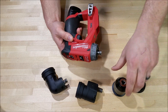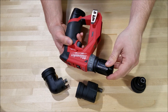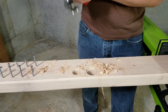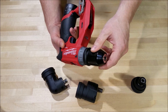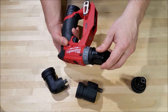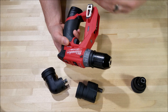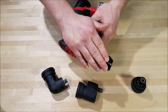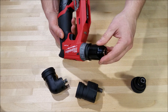Next is the three-eighths inch chuck. I've used this with some pretty beefy bits — I used it with a one and three-eighths inch Forstner and was really surprised the drill could handle it. The only problem was with extremely large bits like that, I actually had problems with it slipping a little bit even with it really cranked down. That bit is really bigger than this is meant to be used for, so if you have really high torque situations, this thing might not be able to hold on to the bit you've got in it.